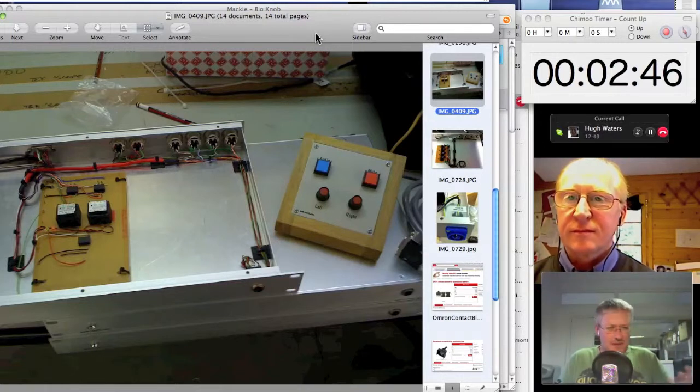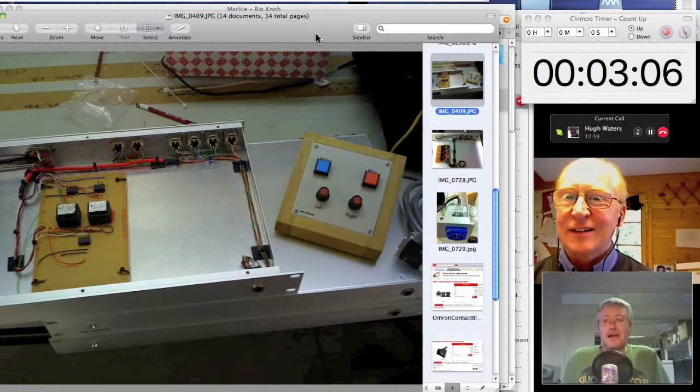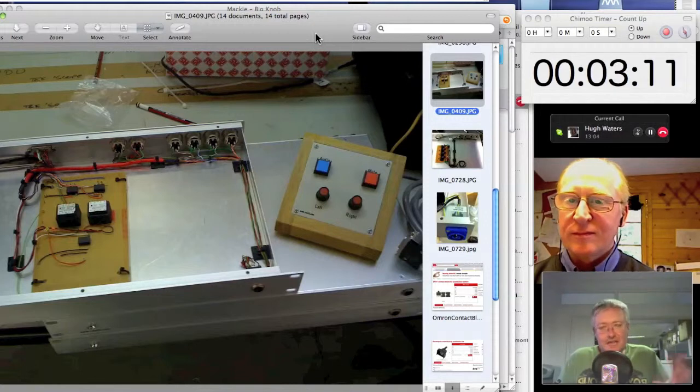Because Digibeta was the mainstay of television editing all through the 90s and the noughties, we couldn't live with this. So we decided we were going to pull apart the deck definitions, because we were very familiar with how these machines worked, and we worked out how to decompile the EEPROM that contained the deck definitions for different VTRs. We knew that the ballistics of a D3 were very similar to a Digibeta, and we thought that if we could decompile it and put in the right ident code, so that when the edit controller asked the VTR what kind of VTR it was, the two-digit hex code it returned would match our home-brewed version of the EEPROM, we'd be away.